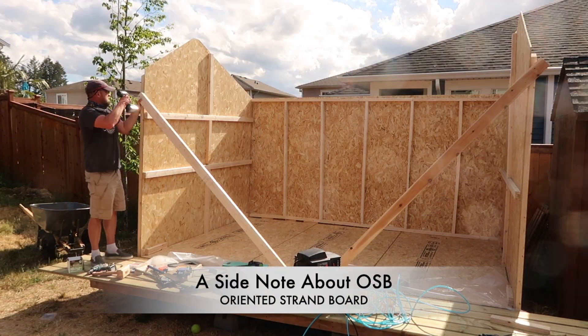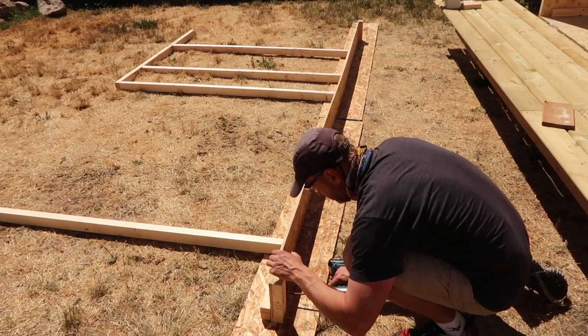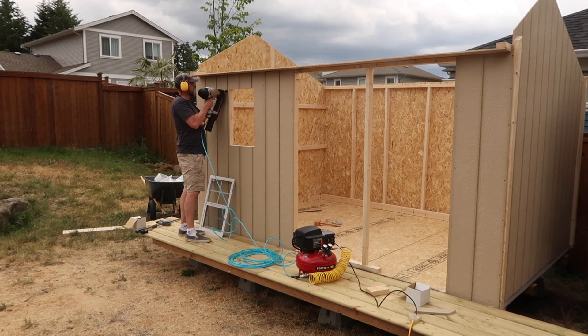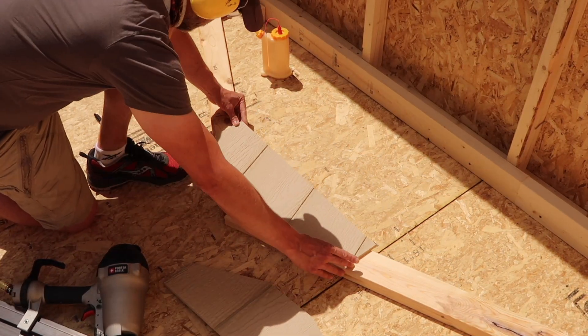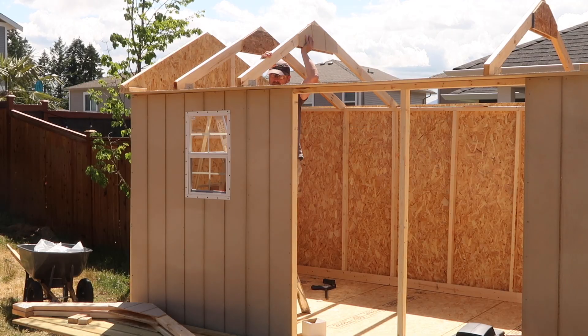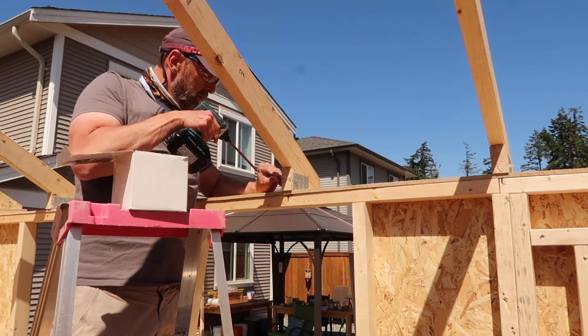Some people complained that I used OSB flooring — oriented strand board, not chipboard. OSB is widely used in the construction industry and has been for 15 to 20 years. You can verify this at any construction site. It comes in four different grades; for flooring, construction grade is usually type 3 or type 4, which is very water resistant. In Canada you'll see houses being built in snow and rain with OSB exposed to moisture throughout the build. Check out The Crazy Framer on YouTube — linked in the description — where you can watch him build a house solo in winter conditions.